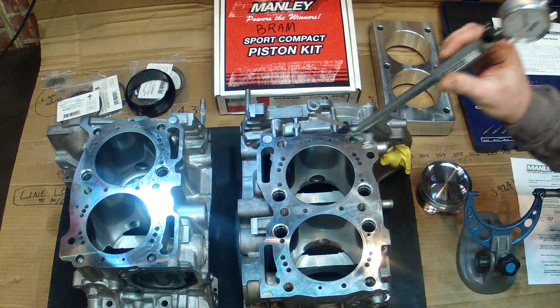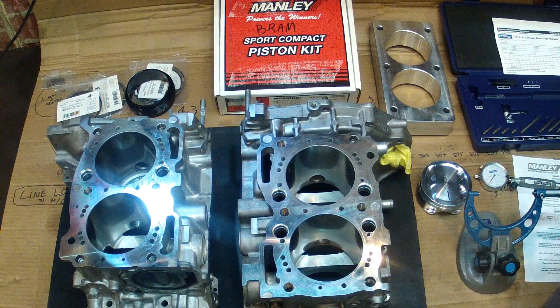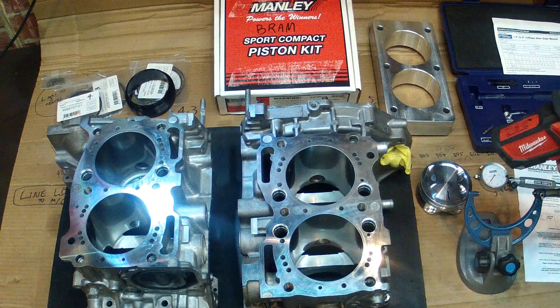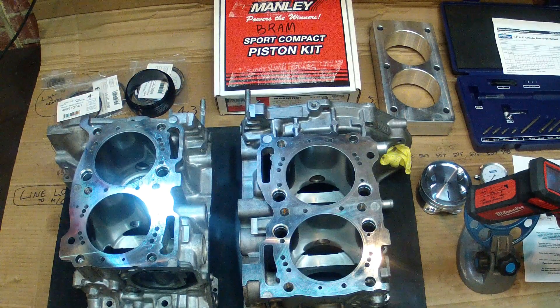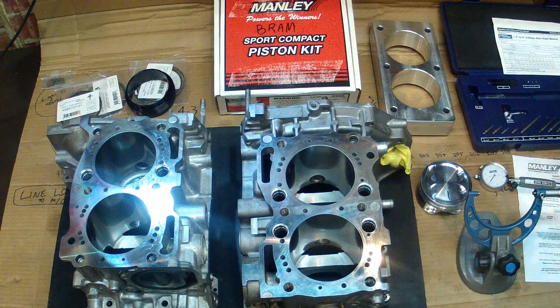We can go through all the other cylinders as well — one, two, three, four — and check all of them. Off camera I've actually already gone through and worked out which pistons best fit each bore. It is interesting to note I did this test earlier today when it was about 15 degrees, and the measurements have changed between now and then when it's 20 degrees. Using a non-contact thermometer, you can see the block is right now 18 degrees, the piston is 21 degrees, and the micrometer is 20 degrees — so we're about in the range where it should be, but I don't have the torque plate installed. That is how you go about checking your piston to bore clearances. I'll see you next time.